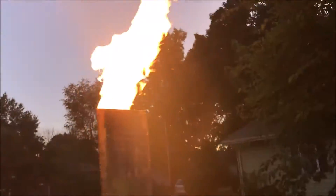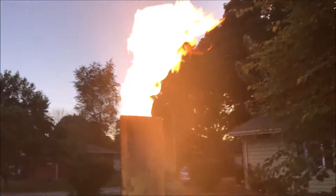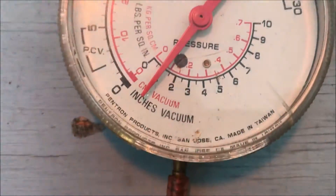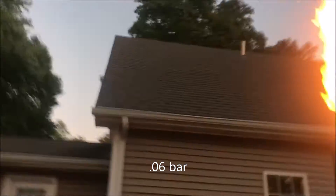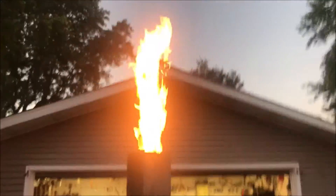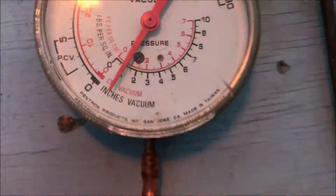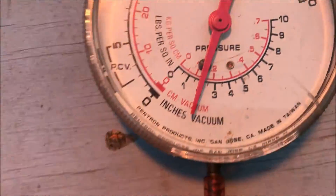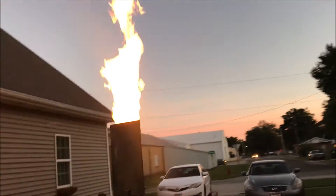Take a look at this flame. We are at our target pressure here — 0.08 bar. So if you think your flame needs to be bigger than that at 0.08 bar, that means I need to increase the size of the aperture. At about 1 PSI, if you think the flame is gonna be smaller than that at 0.08 bar, then the spud size is perfect. We want to have a little bit of restriction there to get decent mixing — that's what's helping us get that high wind resistance.